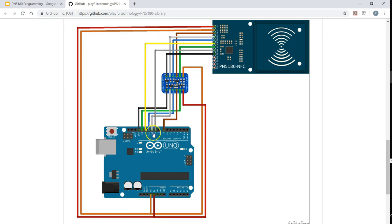Only those signals that go from Arduino into this board need a level shifter. I have already followed this wiring exactly as shown in the documentation. And even though it did not work for me the first time — because I had never used this type of level shifter before — you might come across this issue the first time. You might have missed a couple of the wires. Basically, you have to make sure that the wires are connected correctly through the level shifter.